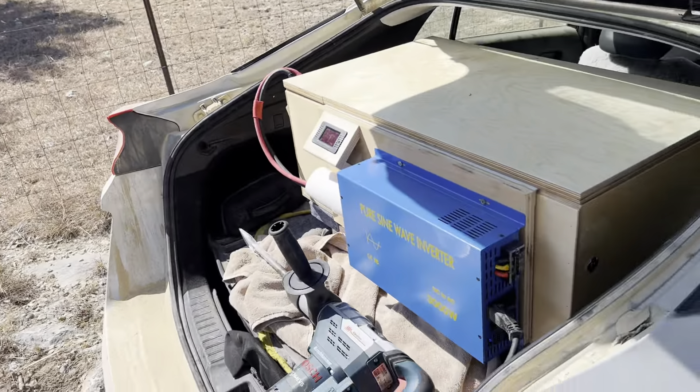This battery holds 14 kilowatt hours of stored energy and right now it's at about 70 percent of its capacity. This big hammer uses about 800 watts with the losses from the inverter. So if you do the math, I could work two days on this rock with a full battery. Even with a two-thirds full battery I could work all day with this thing and not run that battery out, and I don't have to fool with a generator and gasoline and all that mess.